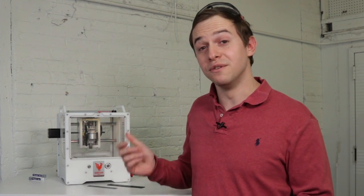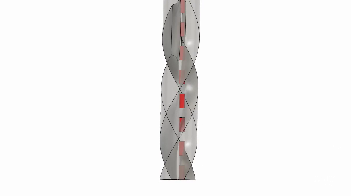Okay, so we've chosen the right endmill for the job and we've leveled our spoil board, but let's talk about one more issue that isn't always at the top of mind: tool runout. Tool runout is when the center line of the endmill is not in line with the center line of the spindle.